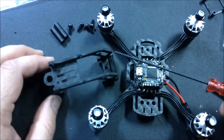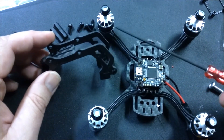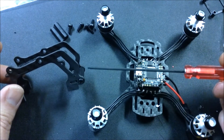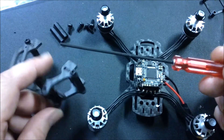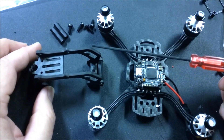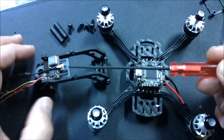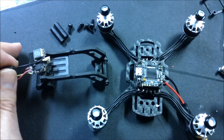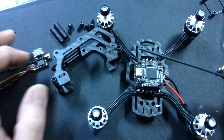The next step is taking your two side plates - there's also a little piece in the center and another in the back, plus your top plate. In your kit you'll find four standoffs and screws, two for each. The reason we're putting this together now is we need to measure our wires from our VTX. Once we get this together we can feed the wires down through the top plate and get an idea of how long they need to be to solder them to the flight controller.